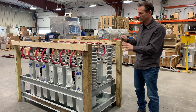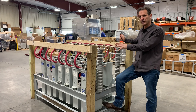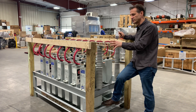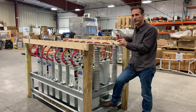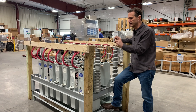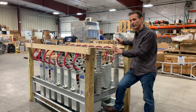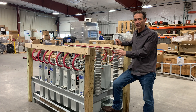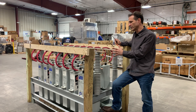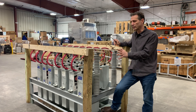I'm going to explain the box. The first thing I want to talk about is it's dangerous. There's a lot of microfarads here. After you de-energize the system, wait at least five minutes before you come in contact with it. Additionally, the terminals should be shorted before you start to handle the capacitors, because a trapped charge could be deadly. It's very important that all trapped charge be removed.